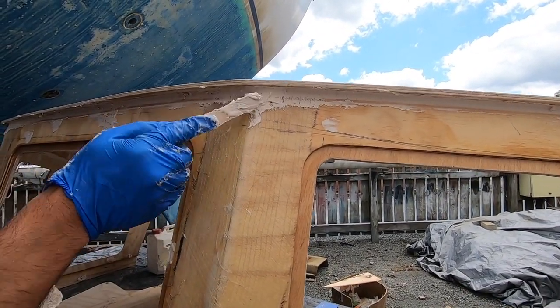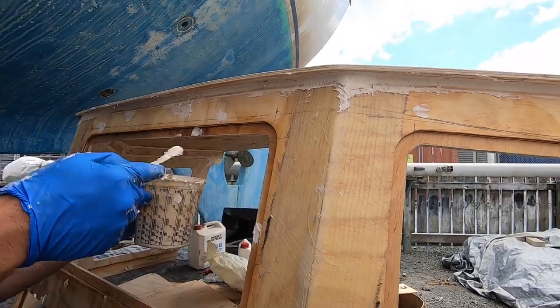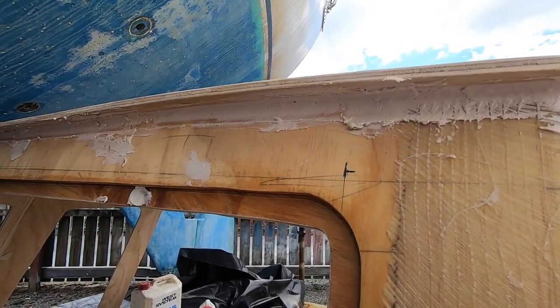It is important to create a big radius with the roof joins because the fiberglass is hard to bend and won't stick on square corners. Also, sharp edges are really dangerous on boats.